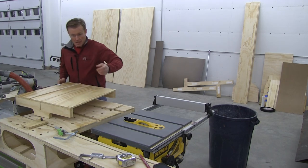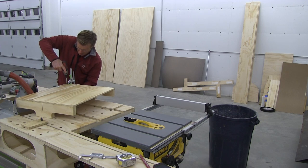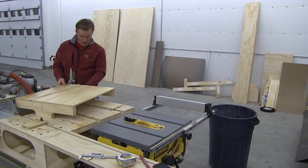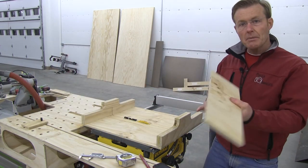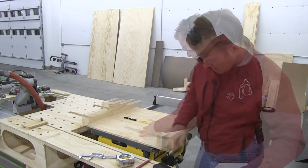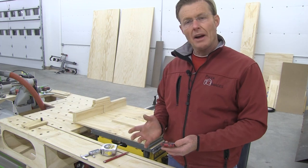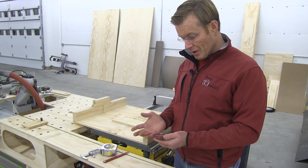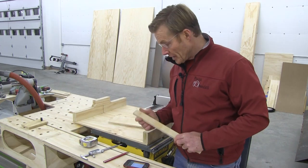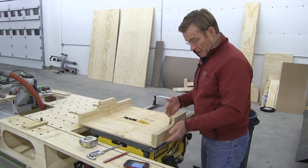I'll move the fence right up against that point and clamp it before drilling. I'll add more screws in the bottom after I confirm it's where I want it. Taking the same test board, I mark it A and B again. My error at this point is negative 0.0015 — the tape measure doesn't even pick up the difference. That's accurate enough for what I'm doing; I might run through the process one more time if I want to zero it in further.